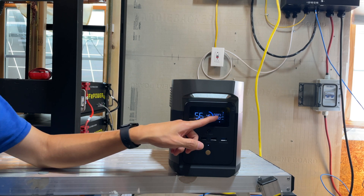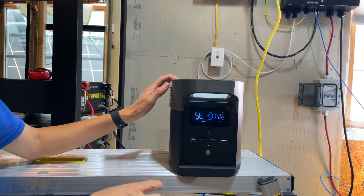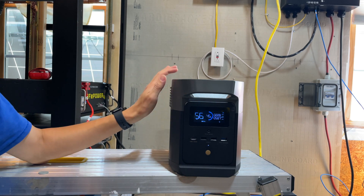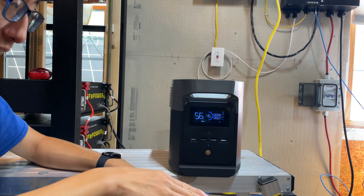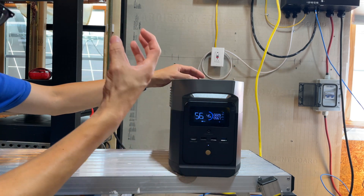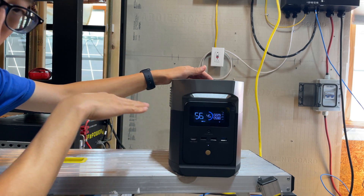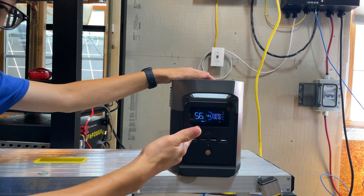Right now pulling about 600 watts out and 220 watts coming in, it's going to run about 56 minutes. I let the room heat up earlier today so the AC would need to pull the temperature down to a set point — so right now it's running in a heavier cooling mode than it normally would. Even with inverter mini splits, it's going to consume a lot of energy to cool the room down. Once it reaches the target temperature, the output will hover anywhere between 75 to 150 watts.